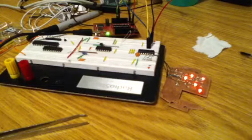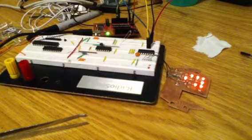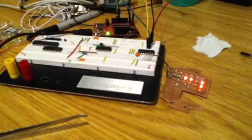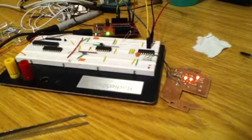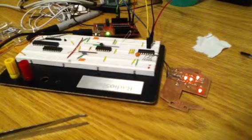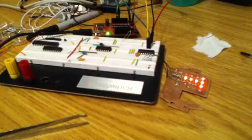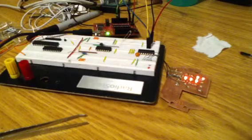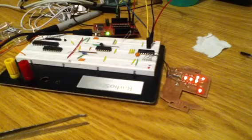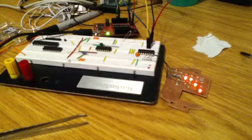I created that second design because this first design had other LEDs that I didn't mean to light turning on, because my inputs on my MSP were not high impedance enough to prevent other LEDs from turning on. The way that Charlieplexing works is you have 2 pins that you control at a time to control one LED on the board, and there are 5 lines here, so there are 20 total combinations of high and low in either direction across these 5 pins that allows you to control 20 LEDs, because LEDs are diodes and so they only drive in one direction. However, this circuit design requires that the unused pins in the current cycle are set to input or high impedance, so that all the other LEDs behave as if they are disconnected from the circuit entirely. Now, that was not the case when the MSP was inside the development board.